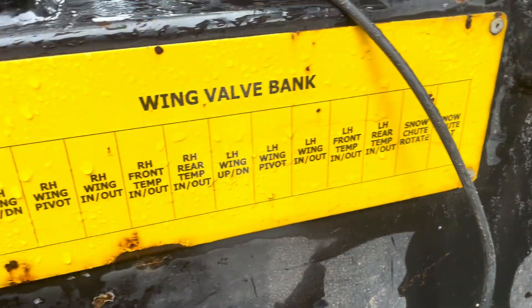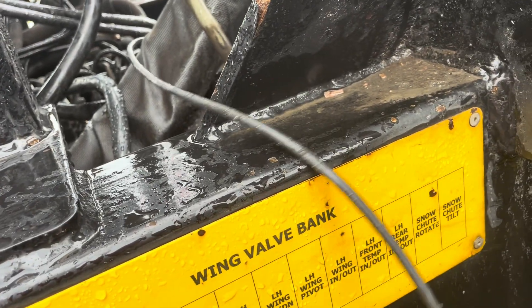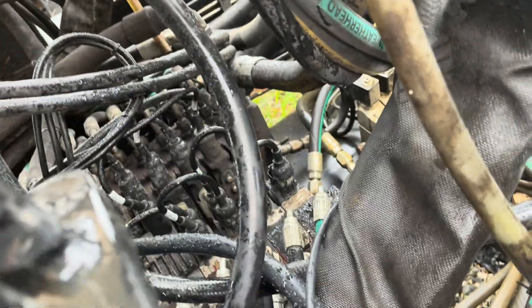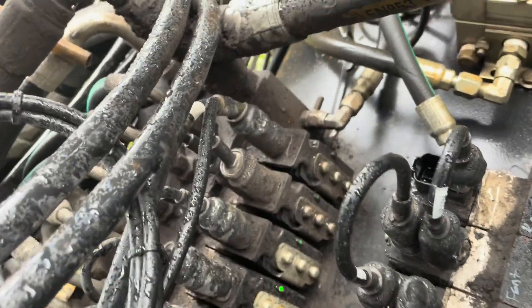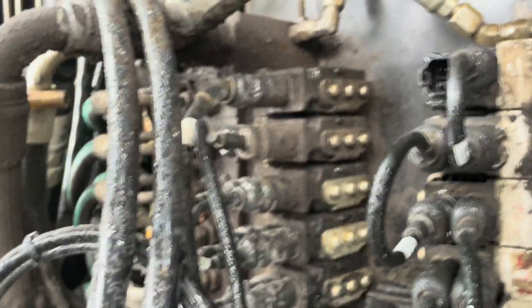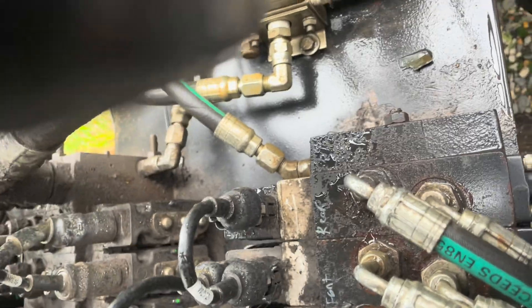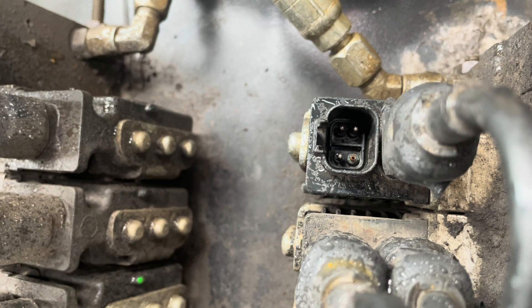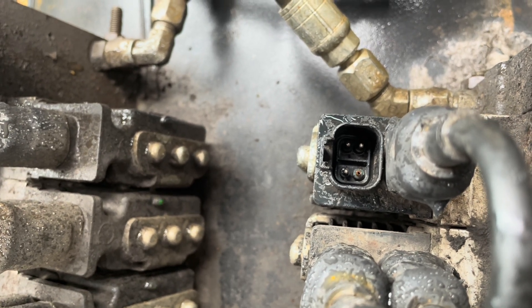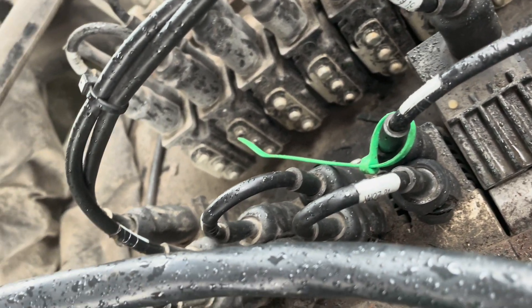This machine is not equipped with this. One of the first things I was going to do was unplug this connector wire that runs from the last valve over to this module, and when we unplugged it, one of the pins came out. You can see some little corrosion down here, and it's not helping that it's raining today. You can see there's a little corrosion down there, and that one pin is broken in half — it's hollow now. That's part of our problem, but we know we have other problems somewhere further down the line, so we're going to look for that.